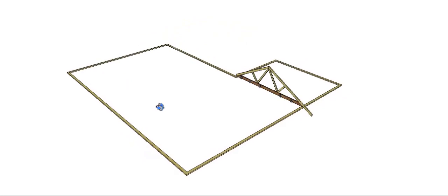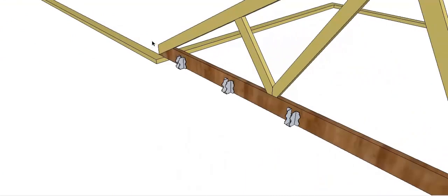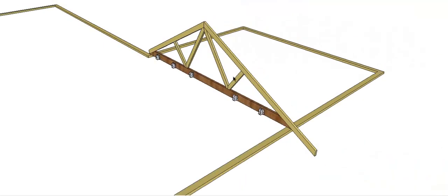The way they do that is with a girder truss. You can see here a girder truss with a slightly larger bottom chord, or a hardwood bottom chord — it spans that gap. You can see it sits on the outside in line with the outside of the plate, and whatever distance that is from outside there to there, you just measure the same here, and that lines up where your girder truss is going to go.